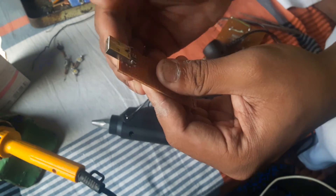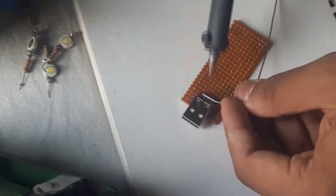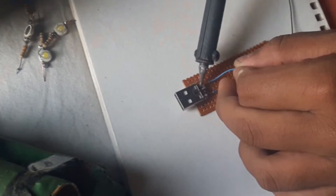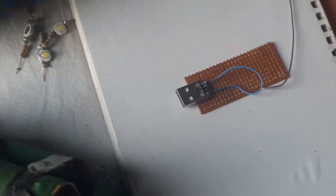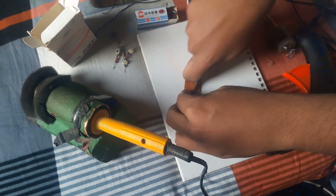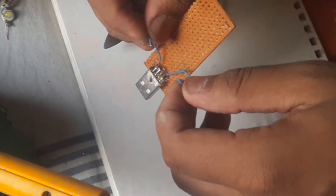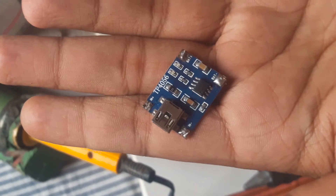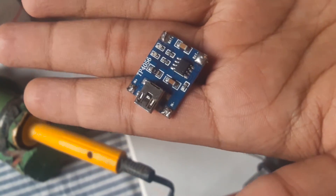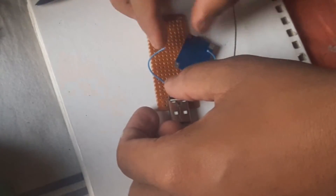The components are barely assembled. You will need to start soldering. First, apply flux and then solder — add it carefully. On the TP4056 board input, two wires are required: a USB jack, solder, and 2 terminals are required to use the battery.